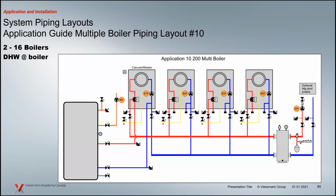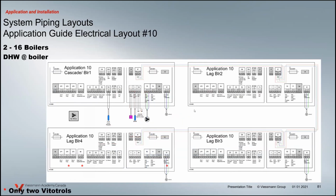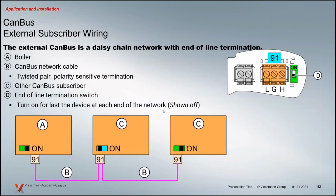It knows if this boiler that's connected to the domestic is going to have to switch to domestic, it needs to turn a second boiler on to make up that loss. The same idea here is the fact that it's an internal cascade.